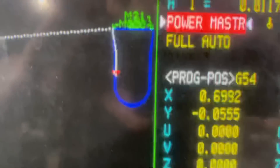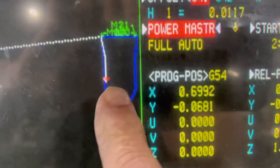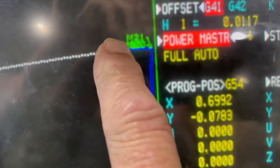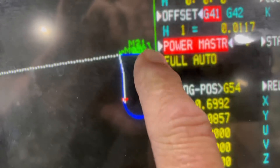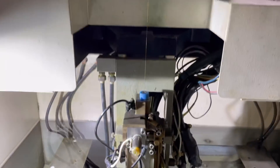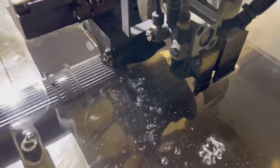Here you can see where it's at on what we're doing. You can see it's cruising right on down through there. The two blue lines you see — one of them is the rough cut, then it'll come back around and do the finish outer cut. You can see it fired up the wire — that's how fast that wire is moving as it's cutting. You can kind of see how it's dirtying up the water, but the water circulates the whole time to keep it as clean as possible.